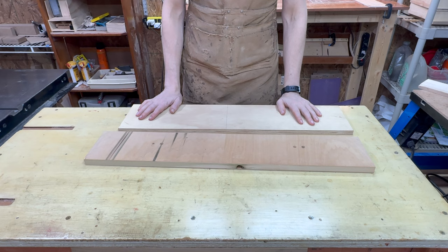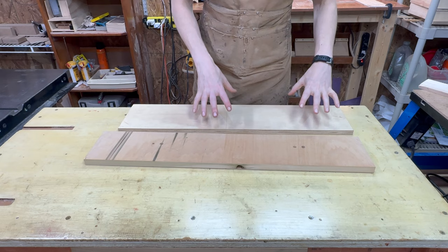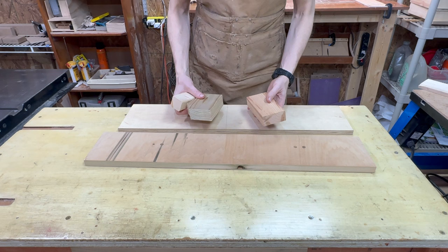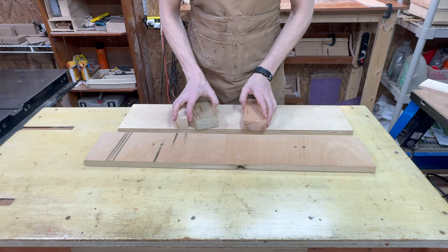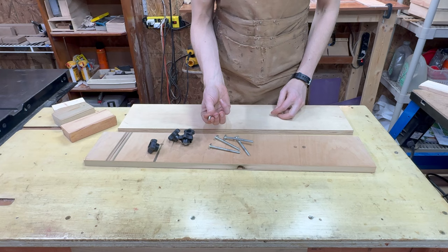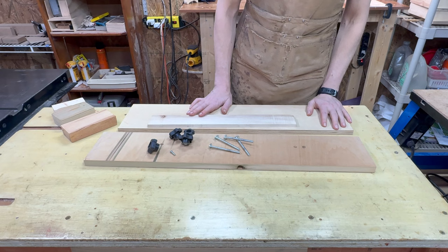For the small tapering jig, the materials we're going to need are a piece of plywood, another piece of plywood, MDF, or something similar for the fence base. We're going to need some scraps of 2x4 for a handle and some clamps, which I'm going to cut out on the band saw — you can buy your own or cut them yourself. We're going to need 4 T-knobs (buy or make), 4 T-bolts, 1 small bolt about an inch long, and a piece of hardwood.